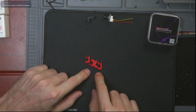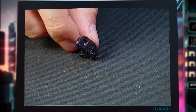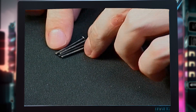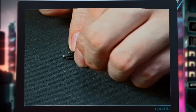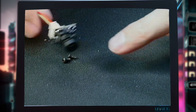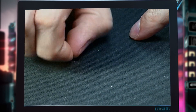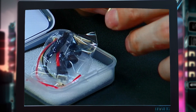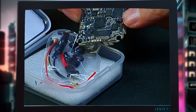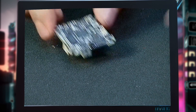You're going to print a TPU VTX antenna holder. You'll need four stack screws — I believe it's 23 millimeters and then one 25 millimeter one, though I could be wrong since I've changed the design a couple of times. You'll also need two screws for the camera and the Caddx Ant Nano — other cameras will work but this is the lightest best solution. Then you need a stack: this drone is designed with AIO 5-in-1s in mind, meaning they have ESC, flight controller, ELRS, and a VTX output on board. I'm not a big fan of Happy Model but it seems to be the best one currently.